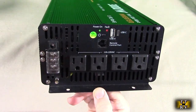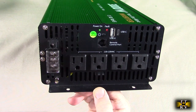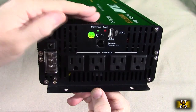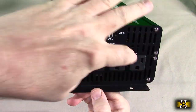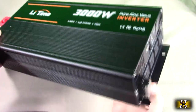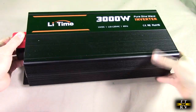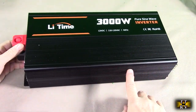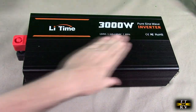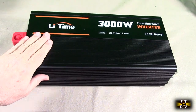There's a fault LED, general fault indicator, power on indicator, and both USB-A and USB-C output ports at about 2.5 amps — really high current. The unit has openings and slots because it has two fans to draw cool air through. On the sides and across the unit there is aluminum with slots to increase surface area so that it runs cool, which is really important for a unit like this.